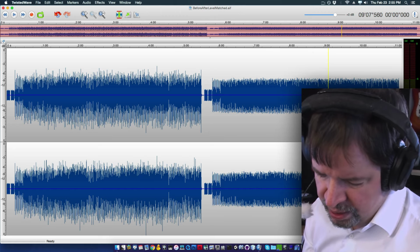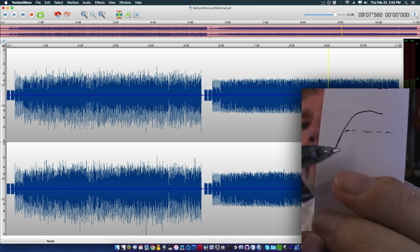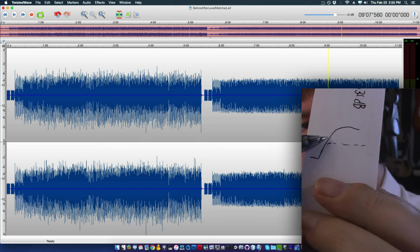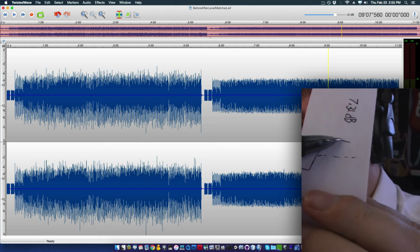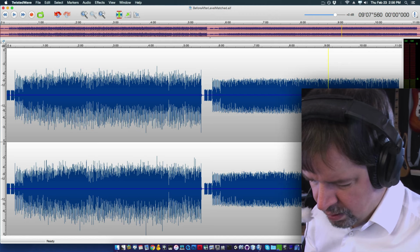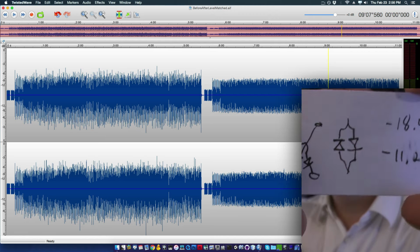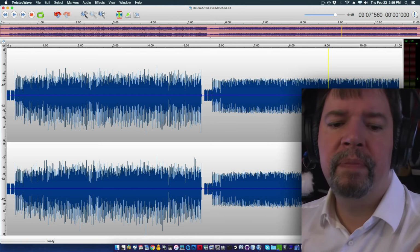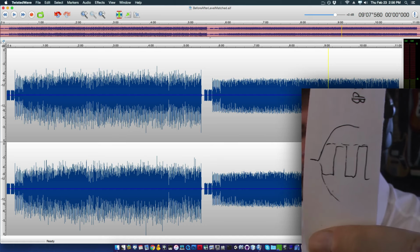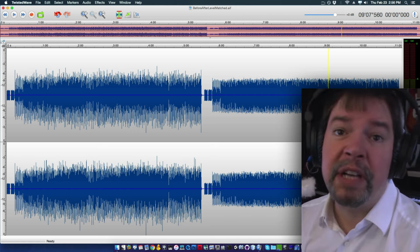So what you get is a signal like this where the voltage will rise, and then this is the point that the diode kicks in, and from that point onwards, anything beyond that just goes to ground. It just stops it at that point. So what you get is an output here. And then when you have two of them wired like this, one going this way and one going that way, you get distortion, because it can only put an output when it hasn't actuated either of the diodes to bleed the energy off. That's how diodes work.